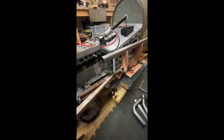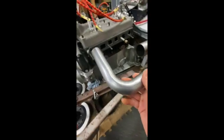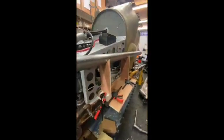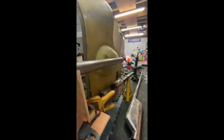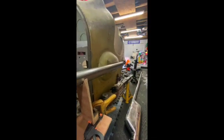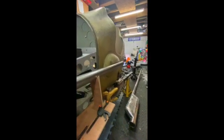So I'm about to start trying to make an exhaust system for this thing. This is the manifold flange, and I've bought a number of pre-bent bits of tube at different angles that I can offer up and work out how it all might go. It's all got to feed into this two-inch pipe, which is quite chunky. I've made this wooden jig which means I can line it up at the right height so it coincides with the recess in the side bulge. Given that the recess has been made, I might as well line it up.